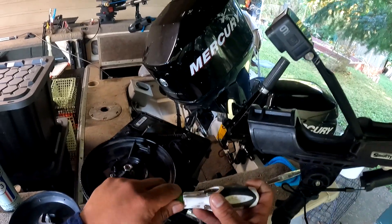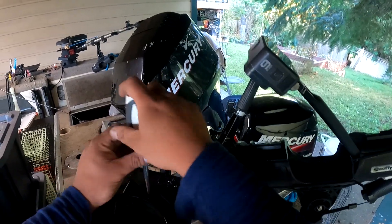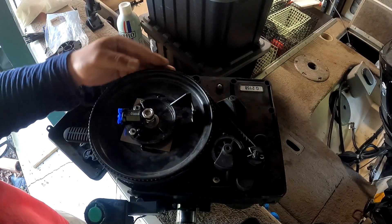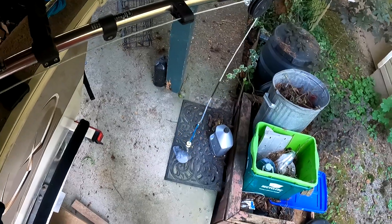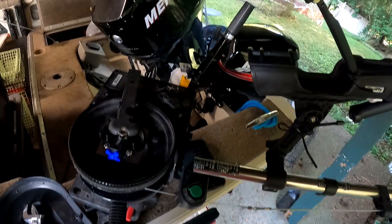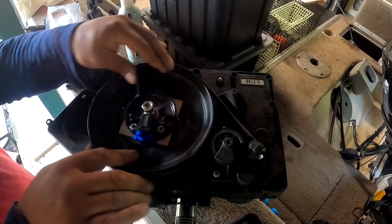Up next, take our Phillips and push in our tensioning wheel firmly. Just make sure you don't over-tighten it so you don't strip the screws. Everything's attached and retracting by itself. Put our emergency brake handle back in and attach it to the little seat right there on the pin. Now I've attached my 15-pound ball to our downrigger line. Let's take a look if it holds the weight — nope, it looks a little light. So we're going to take the nut back off and give it about a three-quarter turn — quarter, half, three-quarter — then put our handle back in.